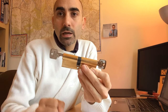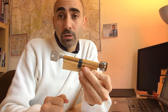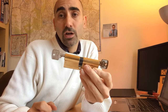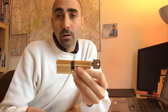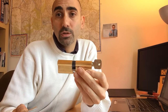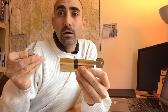Today we're going to briefly talk about a problem that can affect UPVC doors with multi-point locks fitted in the split spindle arrangement, where the outside and inside handle are not fixed and they work independently. This is also known as the night latch function. What can happen is that when you just pull the door shut, the night latch engages, so even though the multi-point system is not engaged, you simply can't push the handle down and open the door — you actually need a key to operate the latch to get back in.